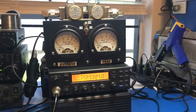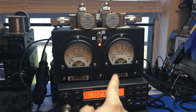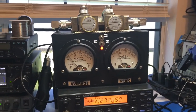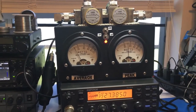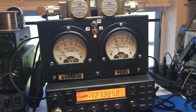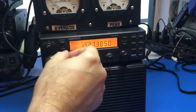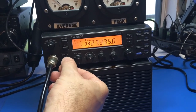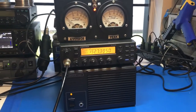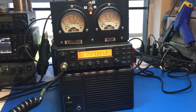I need to add the power on these. Power output — 100-watt slug. We'll go ahead and turn the peak on so we'll see the meter coming out of this radio. Audio check, one, two. So we're already peaking 25 off of this. And we're all the way up. It doesn't really do that much more after that. This beautiful little Motorola transistor built in here. I think it may have been matched up for an amp. You can definitely do that with the adjustments inside — I think there are high and low power adjustments. So you could match this up with a beautiful amp for a base unit or a mobile if you want.